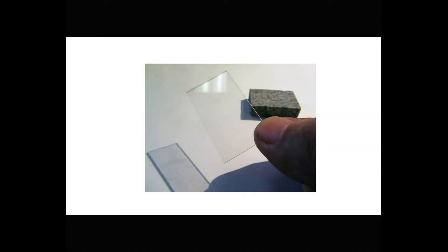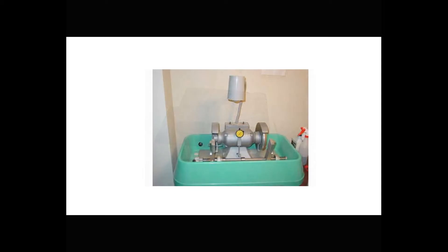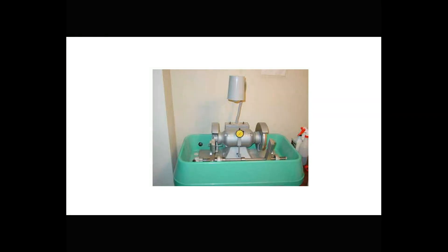The next step is to polish one side of the billet, and then glue it to a glass slide. We cut the billet so it's just a little bit smaller than the slide, and then we use a special epoxy to fix the two together. Most petrographic slides are about 1 inch by 2 inches, which is smaller than the standard ones that biologists might use. We then use special thin section equipment to cut off as much of the billet as possible using the saw on the left side of this device, and then grind to make the sample thinner using a grinding wheel on the right. The ultimate goal is to have a sample of uniform thickness equal to 0.03 millimeters, which is 30 microns — very thin.